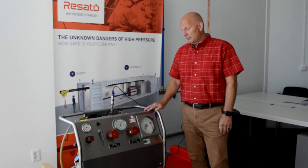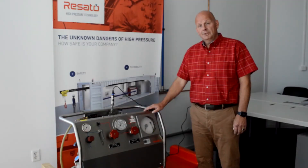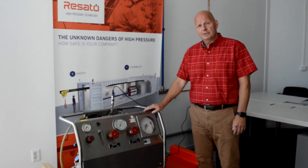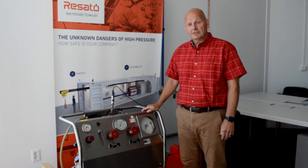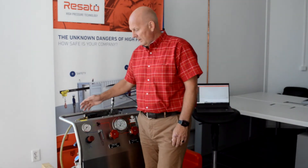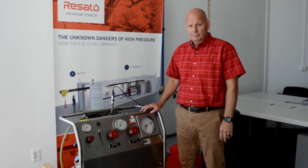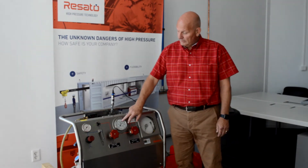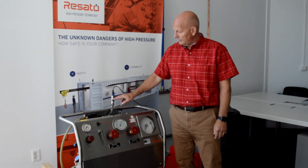This is the RPS power pack, a unit with an air-operated high pressure pump. This means that with an air pressure of 0 to 7 bar a hydraulic pressure will be realized. To generate this hydraulic pressure, a compressed air line, a water line, and the tank needs to be filled. This unit can generate a pressure up to 5,000 bar, so hydraulic gauges and electronic gauges are up to 5,000 bar as well.